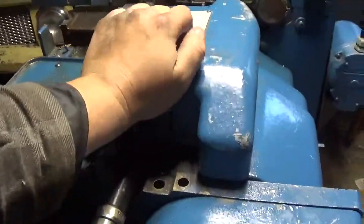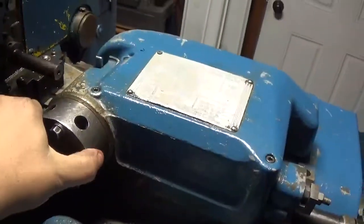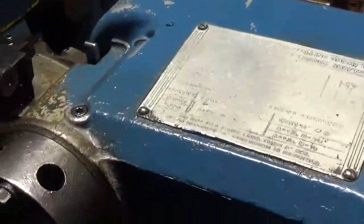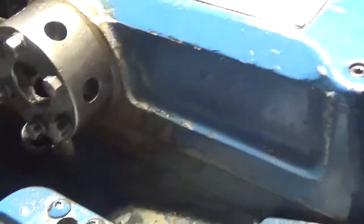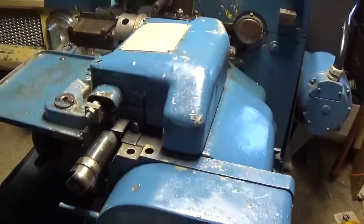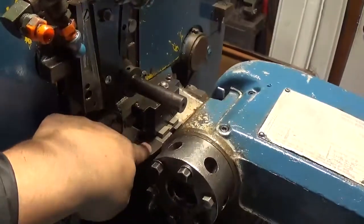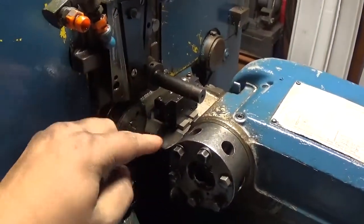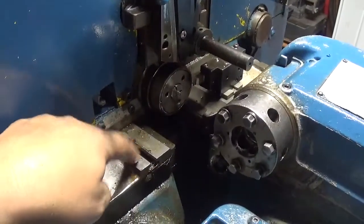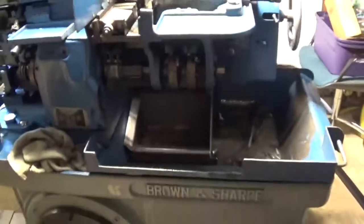This is your turret. I do have to pop this open and redial it because when you hold that release button you should be able to free-spin, and I got it lined up wrong. I also have to adjust the ways on this one because I had to take the whole turret off, clean it, and put it back on. I also need to take off this back one because it's sticky when it runs — it kind of slowly creeps forward. I might switch this around so I don't have to keep reaching behind it.